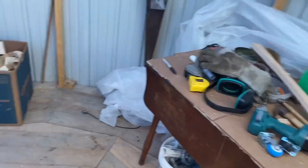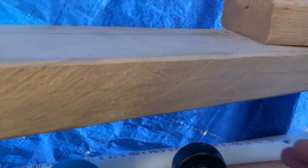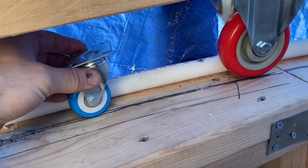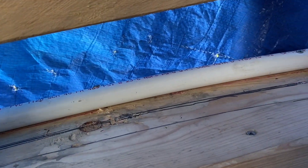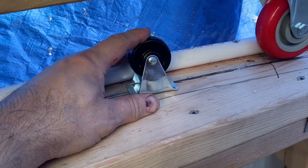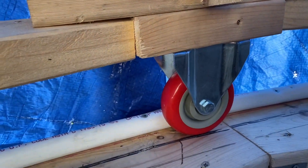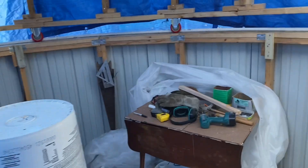The other problem I had is I started off with casters that were way too small — these 2-inch casters. The first ones I got slide very, very well, but they rotate, so if you tried to turn around, the wheel itself would try to turn and rub up against the guide. I was advised to get a fixed caster, which I did. But it also turns out that a larger caster works much better. So I got 8 of these for about $50 — I think they're either PVC or Teflon — and they slide very, very well.